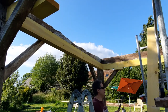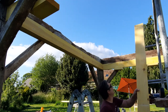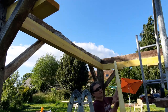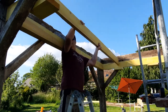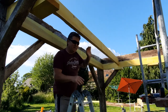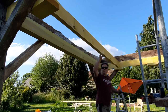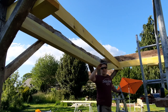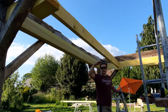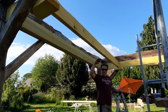If I've got my measurements right, it should go in. Look at that — didn't even need those cleats. On the matter of running your eye down and looking at the timbers: if there's a slight bow in the timber it's called a crown — always put that on the top because gravity and other forces will push it down and eventually it will level off. Always put the crown topside up if you've got one in the timber.